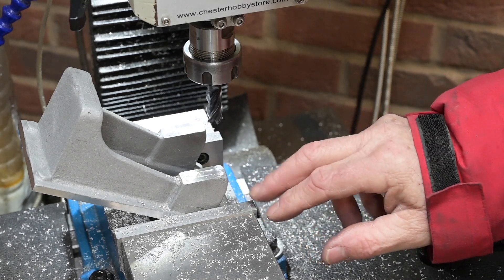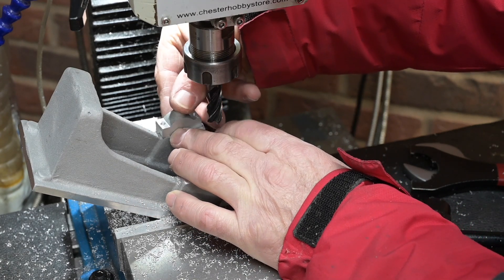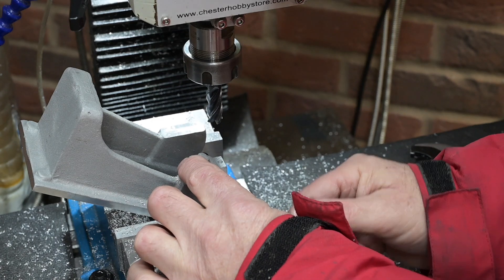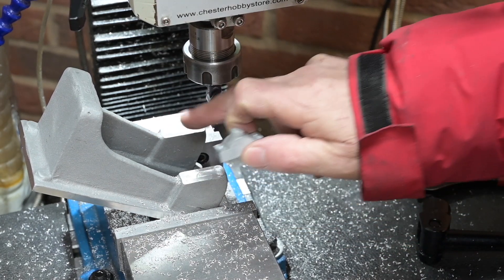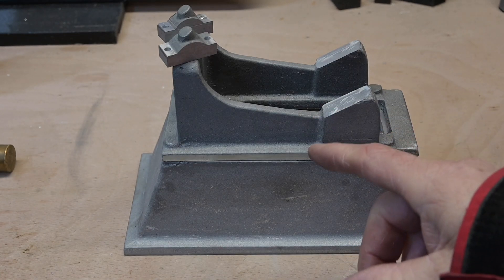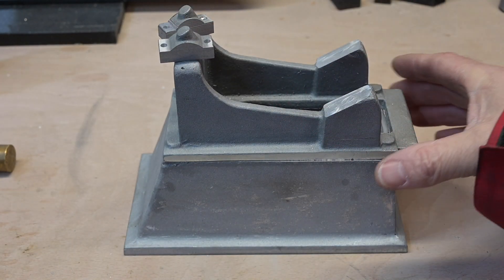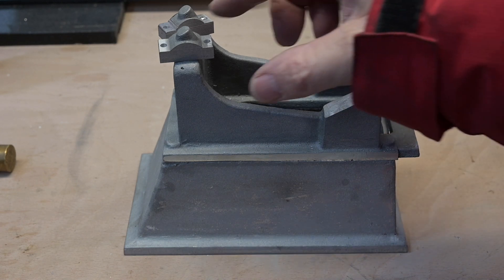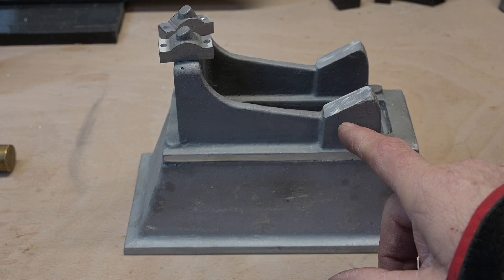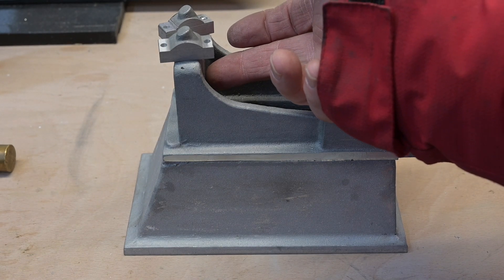I'm not going to be able to machine all this bad casting away because I'd have to be right down to here, so I think I'm going to leave it there. I've got enough coverage for the bolts for it to sit down properly. That's going to be it for those. So that's where we're at with this one — got the bearing caps machined up. In the next operation I'm going to face off these two sides, get the bearing caps drilled and fixed on there, and then we'll set this up in some kind of fixture for drilling out the holes there for the crankshaft bearings, and then the hole through there for the piston liner to come through.